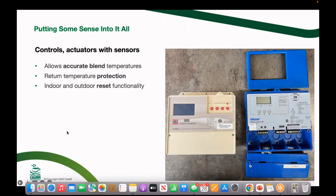Those are two older controls from HBX and Tekmar right in my shop. Your sensor inputs and signal to your boiler all wire into one box; all programming is done with the buttons on there. There's a lot of functionality — you can customize these and really give the customer the best control on their system. Sometimes you need to make a couple of return trips to get it dialed in, maybe shifting the curve a little depending on what they want for comfort — everybody has a different definition.